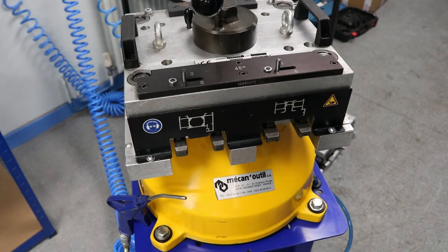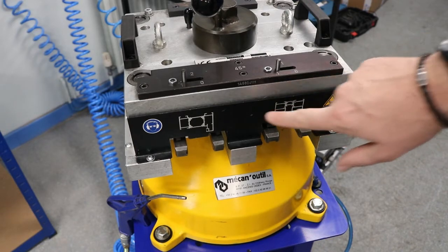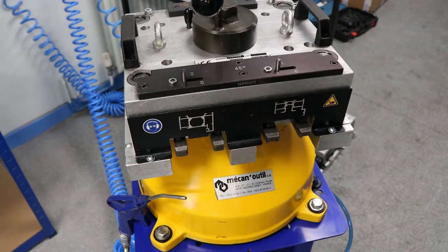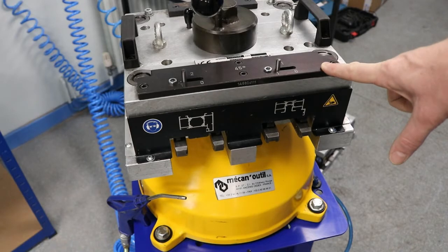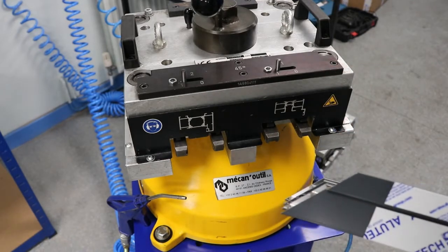This is punch tool one, which punches the holes for the mechanical screw and the glue holes in the outer frame and also the sash. This is for the outer frame section here and this is your sash section here. The outer frame section is for the BF73-0101 and BF73-0102.